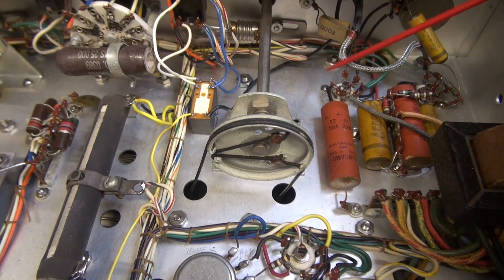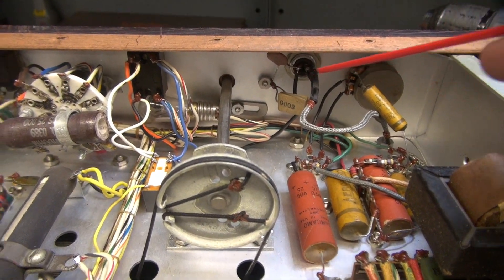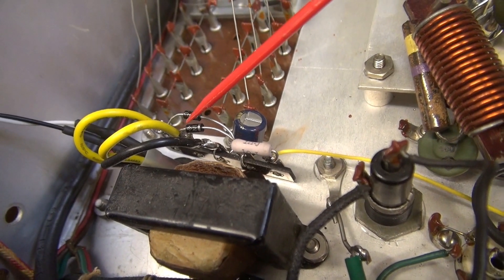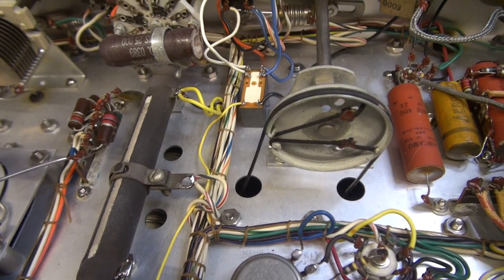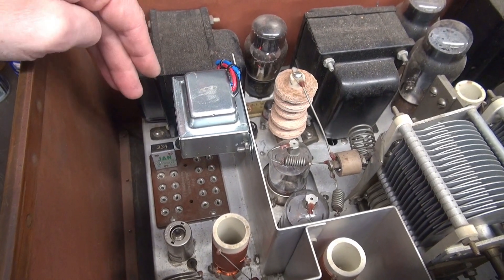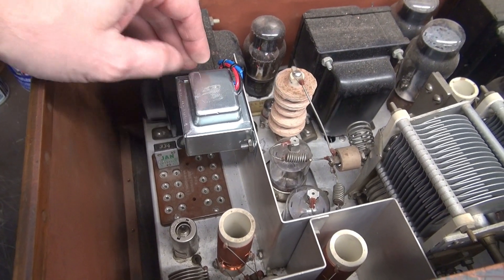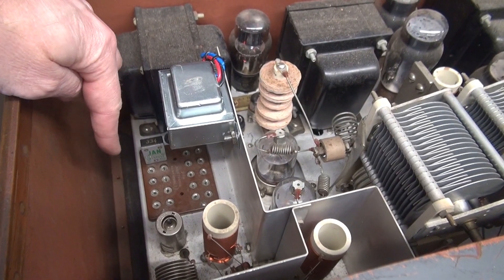The 400 volt switching system has been replaced by a 12 volt relay, and I utilize that same two-pin mic jack up front. If you follow this yellow wire back, that goes to this little rectifier board, and up above I have an 18 volt center tap transformer — so it feeds the little rectifier board underneath. There's an existing hole right back here, so I put a rubber grommet and route the leads through. This is actually the same location that Johnson uses for a little keyer platform in some of the Viking 2s — this one doesn't have it — so you still have full access to your crystal sockets below.